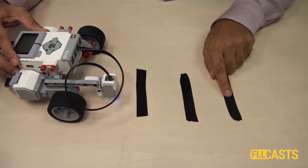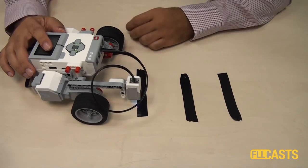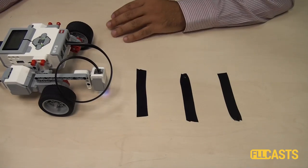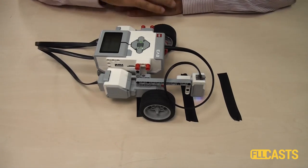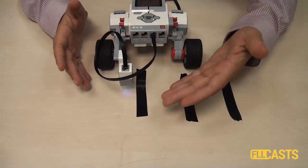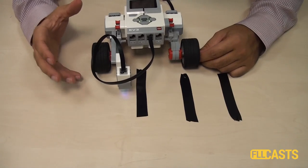The question is how long we should wait after we detect the first line. It should not be half a second — let's try a tenth of a second. I've changed the value in the wait block from half a second to a tenth of a second and I'll now run the program. As you can see, the robot stops on the second line. In the next video we'll try to remove this wait block because, although it is working, it is not a good practice — it's kind of a hack, so it's not a real solution.